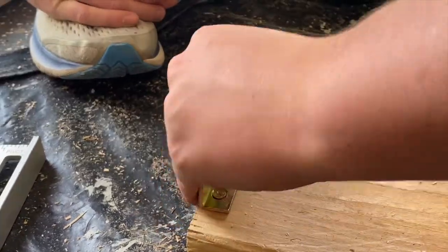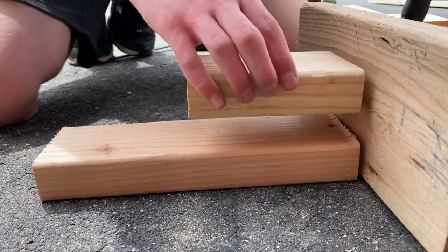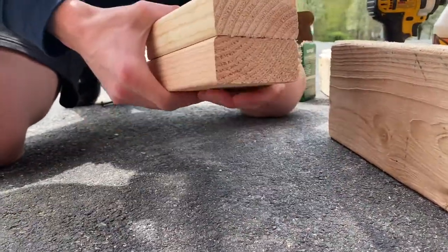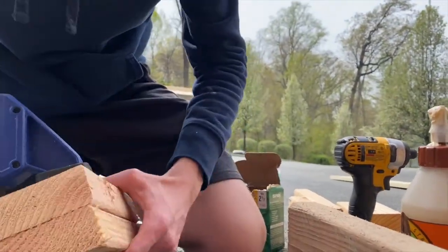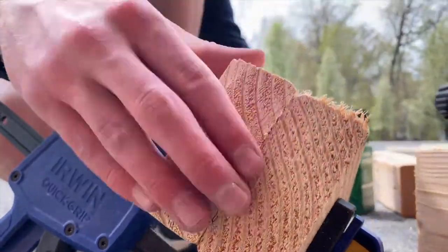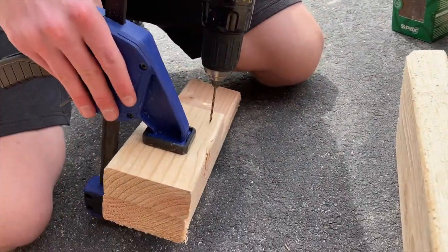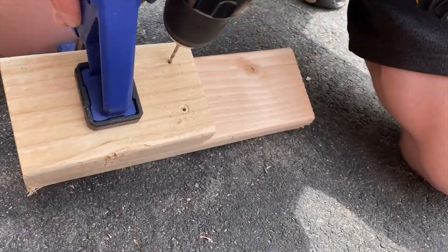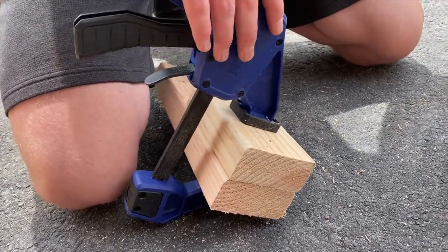The next step is building the feet of the bed. Take your two by four and cut one piece to five and a half inches and the other to 11 inches. Glue it down and make sure they're level using another piece of wood — if the feet aren't level the bed won't stand up correctly, so make sure it's flush. Then take a clamp and clamp it. The wood glue isn't strictly necessary but it helps with structural integrity. Once clamped, drill pilot holes and use your two and a half by eight inch wood screws — I like to do three or four pilot holes, two on top and one or two on the bottom.